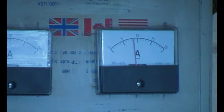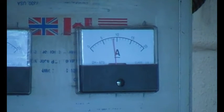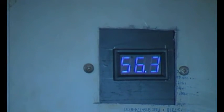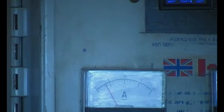We've got two pairs of panels and one pair of panels. Because they're wired separately, the charge controller can switch off the two pairs, leaving the single pair to keep up with consumption. As the sun moves round, both stay on and the voltage is 56 volts. The two pairs switch off at 57 volts and come back on at 54 volts, whereas the single pair switches off at 58.5 volts and switches back on at 55 volts.